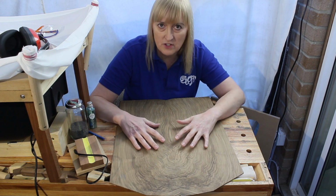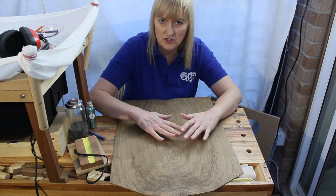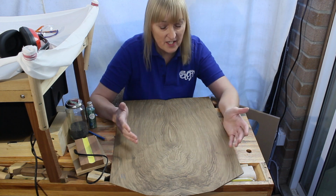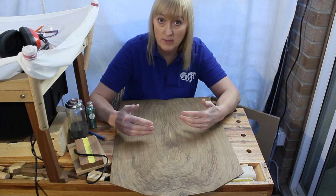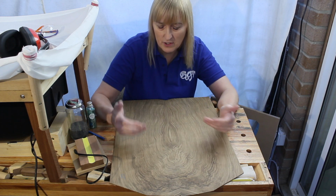If I like the sound of this guitar, if it all seems to be behaving really well, then maybe one way we can use to thickness the next guitar plate would be to take it down until its fundamental frequency at this size is 80 hertz. I'm not saying that's how I'll do it, but it is a piece of information that we can use. It's always a good idea to keep your information from each guitar, and then you can make comparisons as you go along.